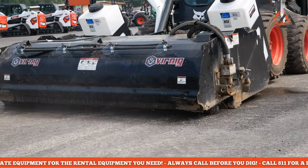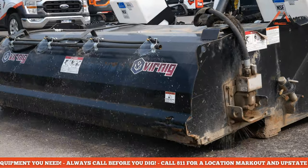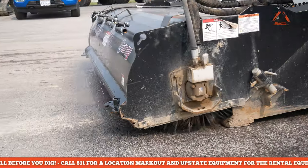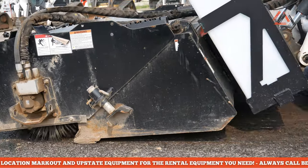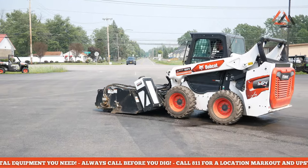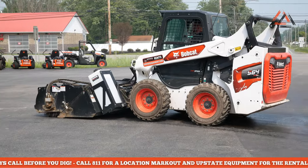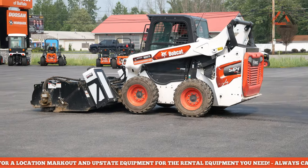To explain the operation for those who don't know: it's got a motor on either end of a spinning drum, and that drum has bristles attached to it. In this video they're spinning so it's kicking material directly into the bucket. When you go to dump, you can actually reverse the bristles and have all that dirt spin out and throw out.